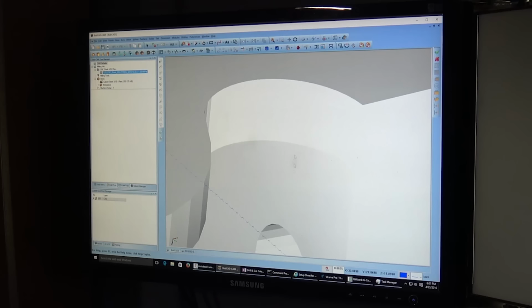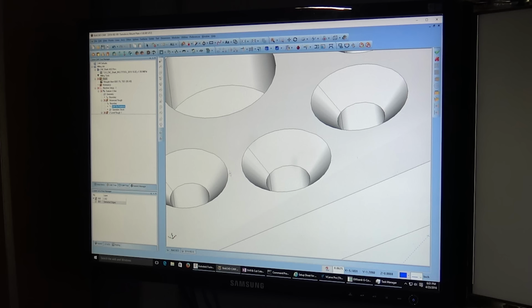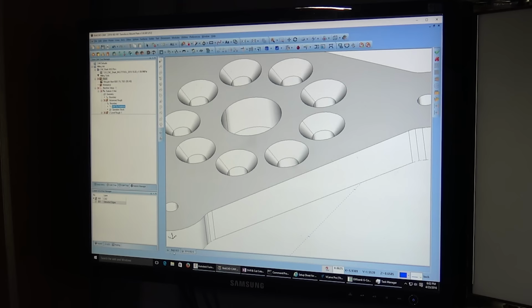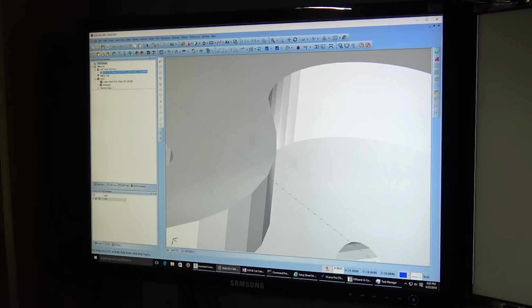So now you went ahead and created it on the computer. We had the CAD design that was compatible with your particular CNC at this point. Any CNC. Right. It's a 3D CAD. Yep, so 3D CAD, but it was better than the STL that I basically gave you. Notice how there's no lines here, whereas on the other one, you'll see everything comes in, it's got these lines because the edges are defined in a step file, but they're not defined in an STL file. They're all just polygons and trapezoids, which means that there's no actual arcs, there's no actual lines, it doesn't know what a hole is, it's a mess.